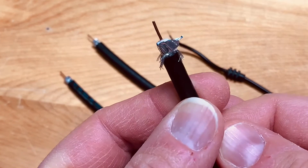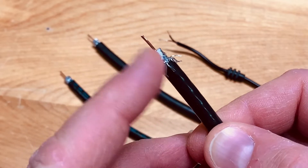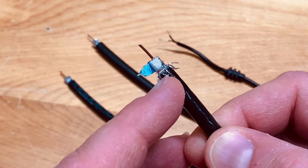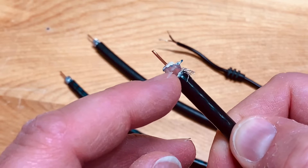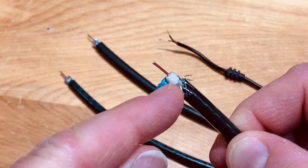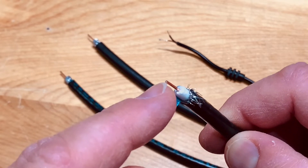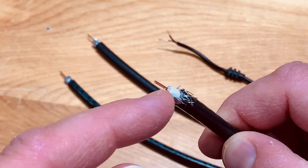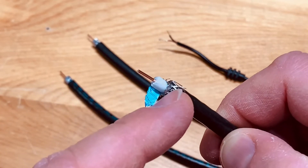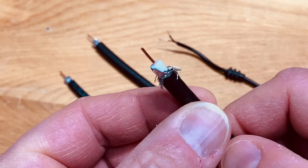Looking at a piece of coaxial cable up close, what you have is the outer jacket. Underneath that is braided shielding, which offers the first layer of shielding for the signal. Next you have a foil wrapping, and then a plastic tubing called a dielectric that separates the shielding layers from the center copper conductor. The center conductor is what carries the TV signal, and the shielding layers are just for protection. The more layers of shielding you have on your coax cable, the more signal loss is prevented.